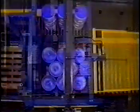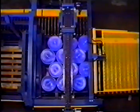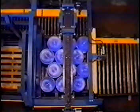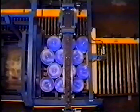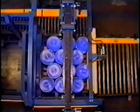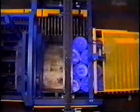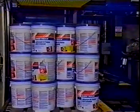As the final row conveys in front of the wiper, the wiper moves into position. The anti-tip device comes down and the stripper plate moves back. The strip out fence exhausts because your tapered pails have to sit properly on the pallet — this allows that to happen. The stripper plate loads another pallet and moves forward, conveying the full pallet load onto the discharge conveyor. Now it's ready for the next load.